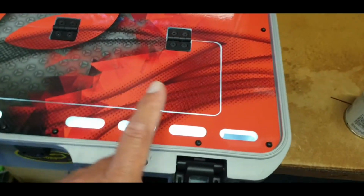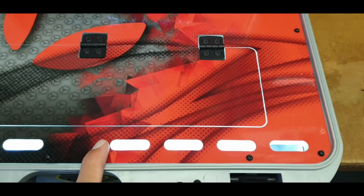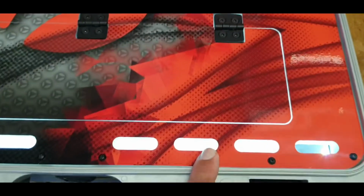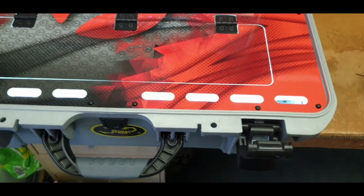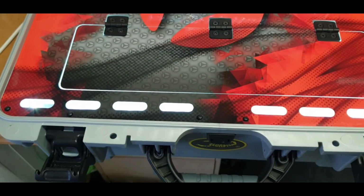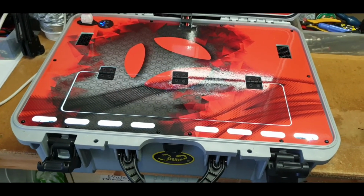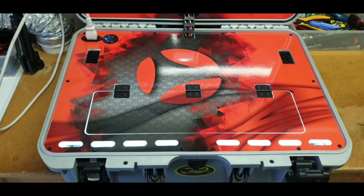The other change we made on this, we fitted some RGBW LEDs inside under the deck. These are the first time I've used this type of LED. So they have the usual red, green, blue LED, and then next to it they have a pure white LED as well. So as you can see, it's currently set to pure white, which is quite nice. So you can also have the range of multiple colours in the RGB spectrum, and then obviously pure white, and they do warm white and cool white, I think, off the top of my head as well. They give you a remote, but the controller on this is a Wi-Fi one as well. So you can actually access more of the colour choices, if you like, via the app on your phone, either Android or iOS. Obviously I'm Android, but I think Adam is iOS from memory. So you can have a play with that.